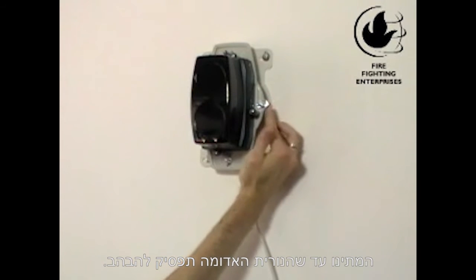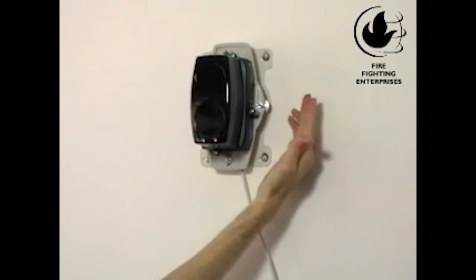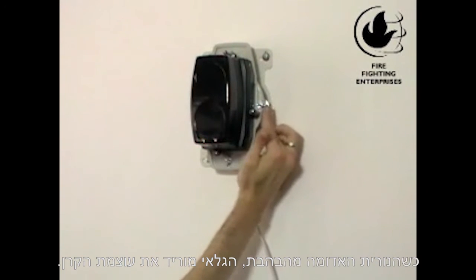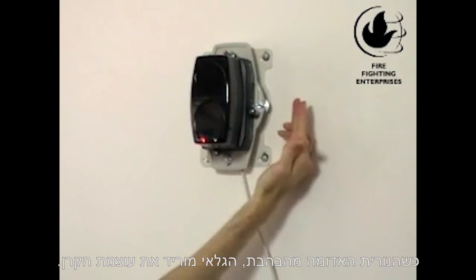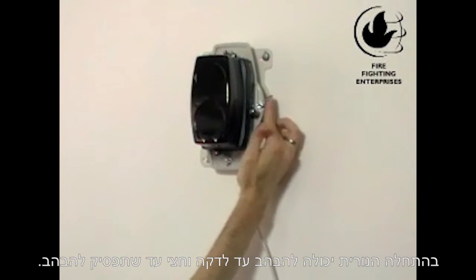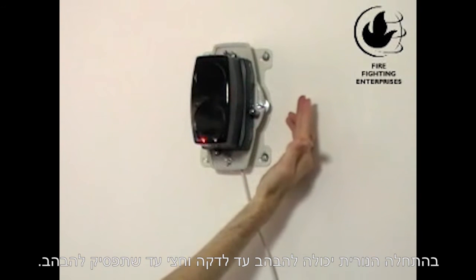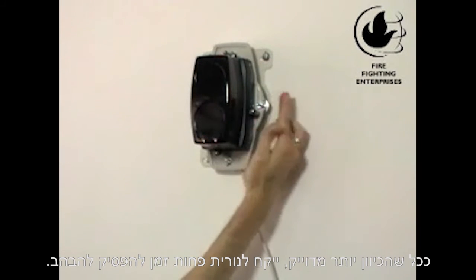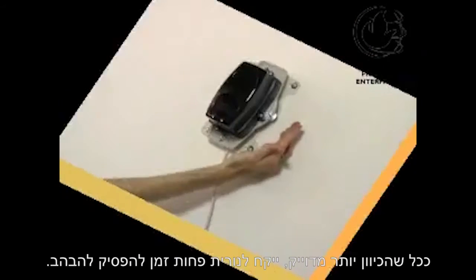Wait and let the red LED go out. While the red LED is flashing, the system is reducing its transmit power. Wait for the red LED to go out. Initially, it can take up to a minute and a half for the LED to go out. The closer you get to the center of the reflector, the faster the red LED will go out.